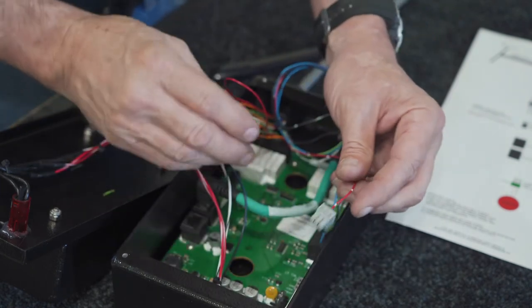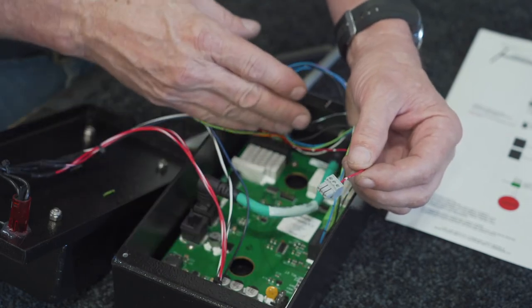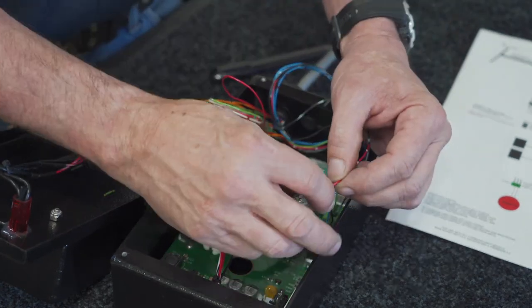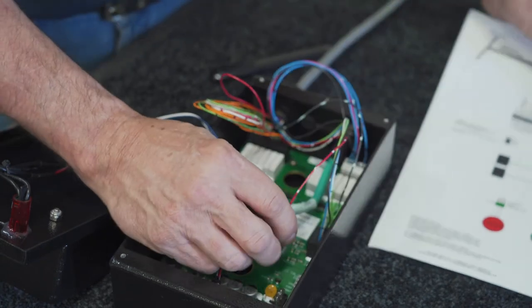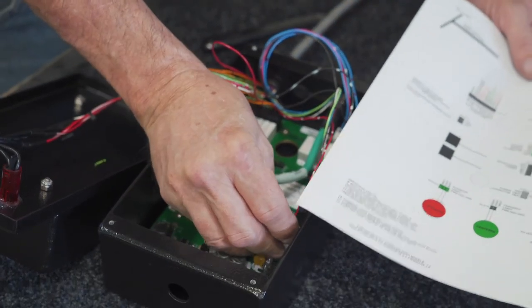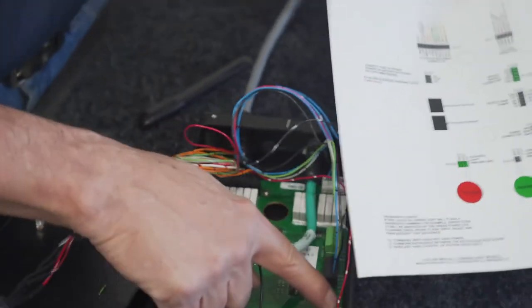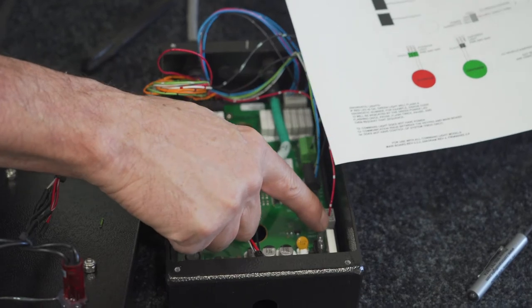Plugs in. The last wire you'll have in there is a red with a white. This is very critical. There are three power wires in here, actually four if you count the blue red. This is one of these power wires. This will go into the center port right here on the schematic, but it also does require both above and below it. So above it, you will bring in your vehicle ground to the port above, and then vehicle power down below.